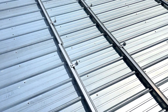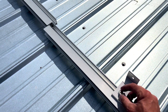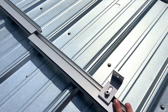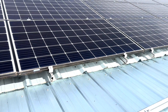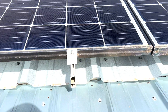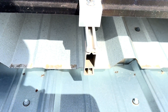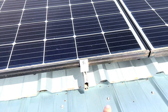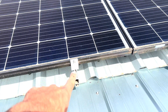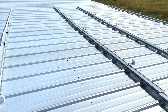So far I really like the racking system I got off Amazon. It's all finger bolts and they all use a six millimeter Allen wrench — for the brackets on top too. It's been really easy. It's a different system than what I used for my first ones. The first ones I used had a couple of different sizes of nuts and it was a little tricky. That one was from Missouri Wind and Solar. This Amazon set I think I'm liking better — it seems like everything only fits one way, and it's been super easy to use.